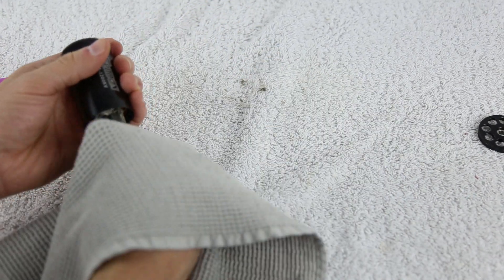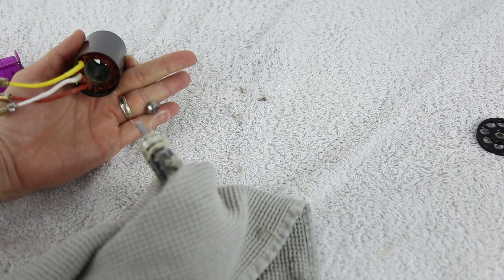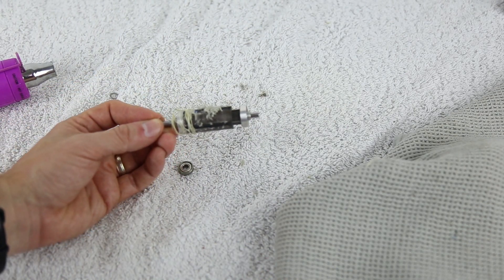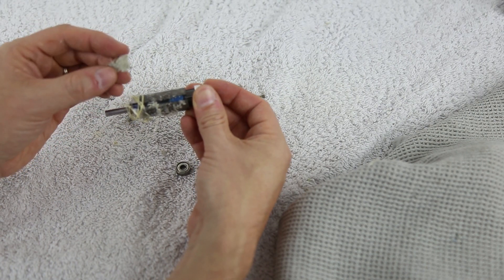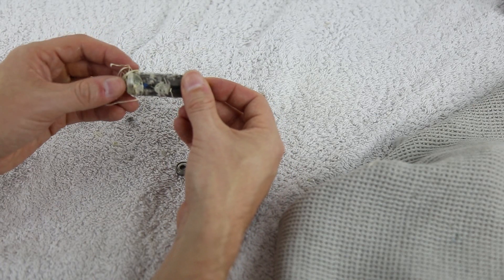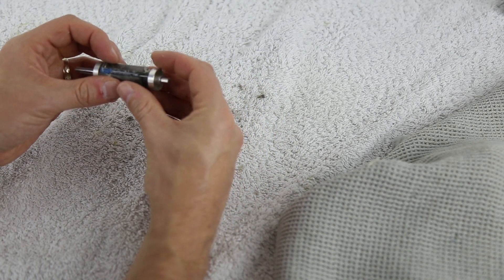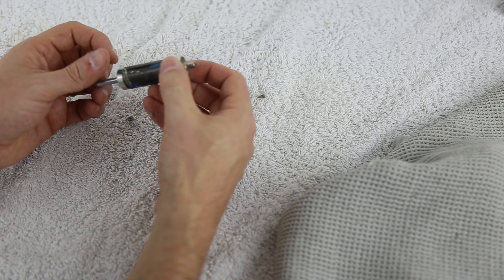We got that out a little further and we're just going to use the cloth here and pull the rest of this motor out. There we go — a bearing came with it. So there's a bearing sitting there and our rotor. With the rotor now removed, we can see there's a lot of material here in the shape of our rotor — rounded, with a huge clump of it sandwiched together. More of this material is coming apart off the rotor as well. It looks like all this material was positioned to hold the rotor tightly and keep the magnets from coming loose, but tons of it has failed — and that's exactly what happened in this motor.